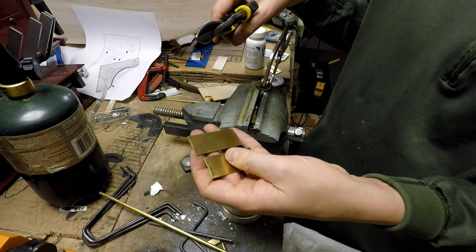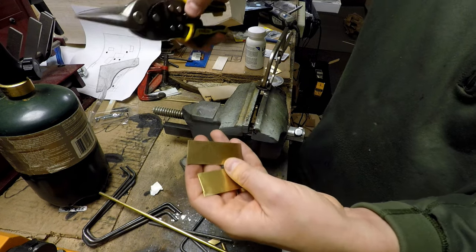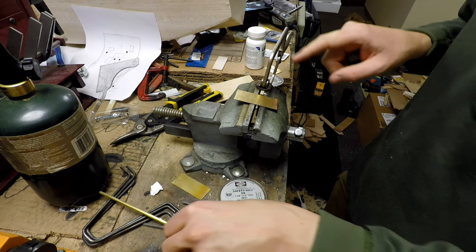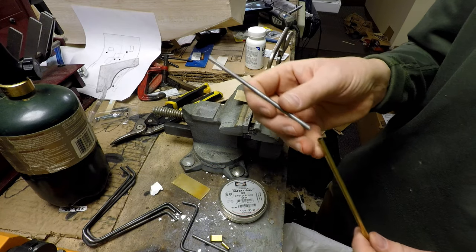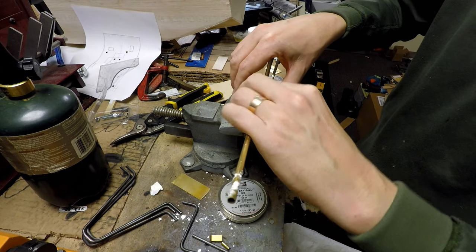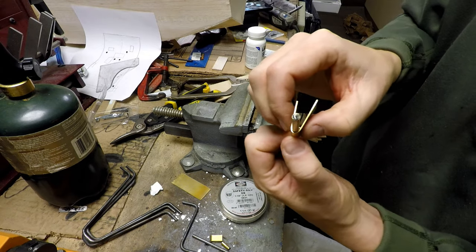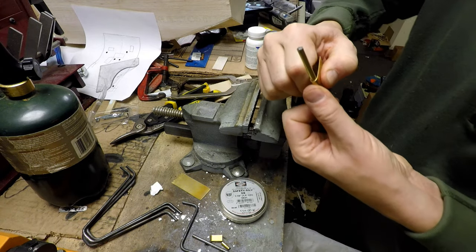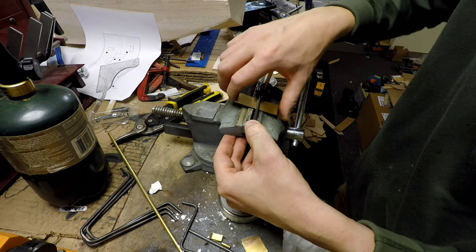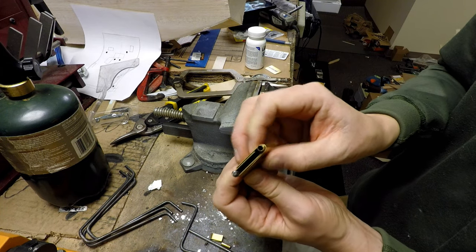The last pieces to form are the brass parts that make up the hinge between the upper and lower support arms. I cut these at about two and a half inches long using tin snips — a Dremel tool with a cutoff wheel works just fine too. To form them, I clamp them in the vise, take some leftover 5/32 wire, and fit it inside the brass tube which becomes a spacer. One piece ends up slightly narrower and fits inside the other.